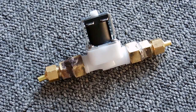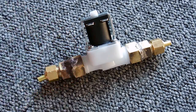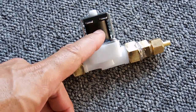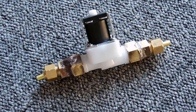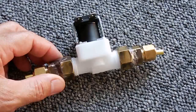Welcome to Electronics and More. In today's video I'm going to be disassembling this normally open solenoid valve to show you how it works. There are two types of valves: normally open and normally closed. The type you're looking at here is less common — it's a normally open type where water continually flows across the valve until power is applied to the solenoid, creating a magnetic field which pulls on the plunger, turning off the flow of water.